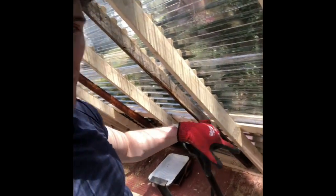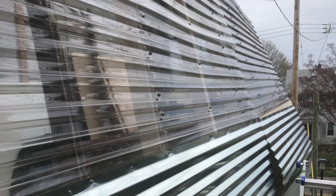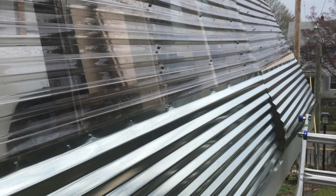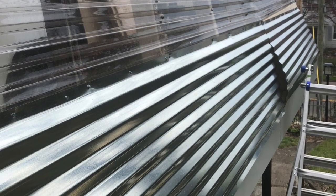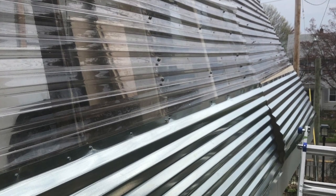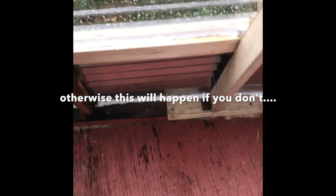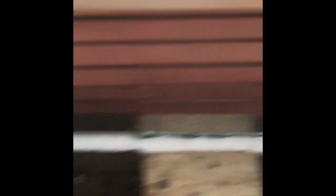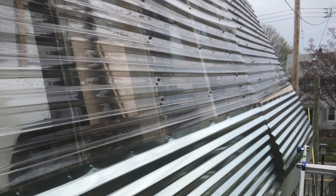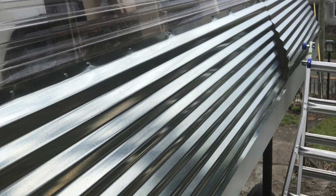Here's an outside view, and I made two mistakes. Aside from the big divot in the middle where there's a hole, I also screwed the aluminum panels on top of the plastic panels when in reality it should have been the opposite. When water runs down the wall now, it seeps through that gap and comes inside the greenhouse. About three hours into rain, I'm saddened to say we have a minimal leak. So I had to remove the panels and do it the right way — I briefly considered just using silicone, but decided to take it off and fix it properly.